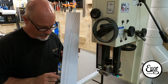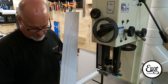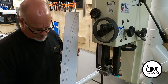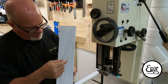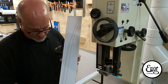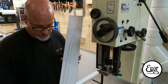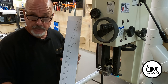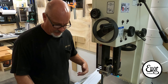So I'm getting ready to cut this guy out, but I wanted to point out something. I drew on the fretboard and even the strings, but I'm going to cut it so I'm cutting the fretboard off and the little cap off the top too. I want to get it down to just the actual neck itself without the fretboard and without the cap, because that's what I have to cut out first before I glue those things on later. So this is going to be a template for the main body of the neck.